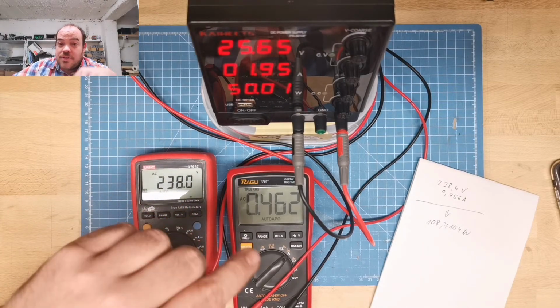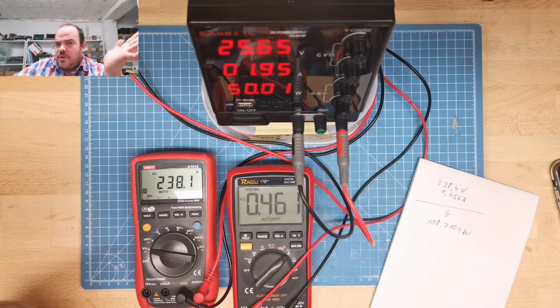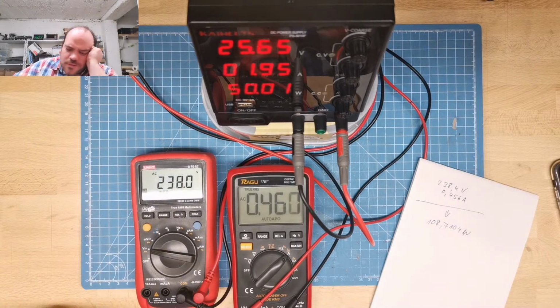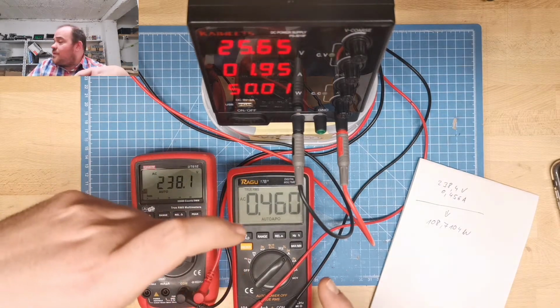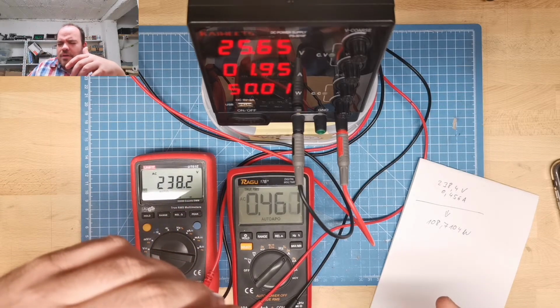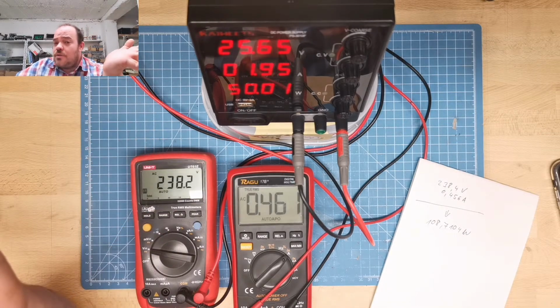And the meter just leveled out. So the power factor is bad, about 0.5. But I'm not sure how the efficiency is. This I have to read up on. Or I need the special meter that shows the real load and the capacitive load. I forgot the name. The parasitic load.